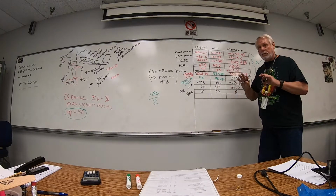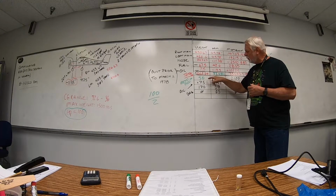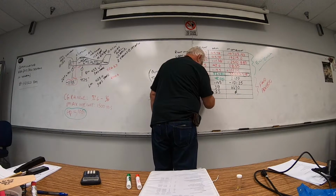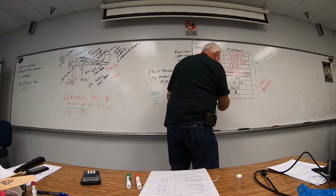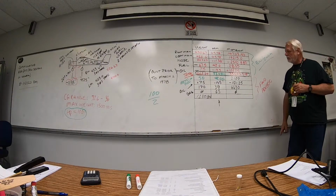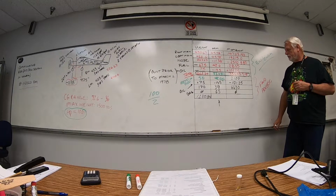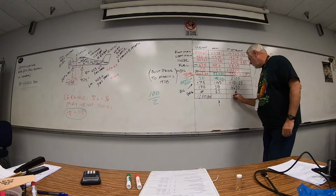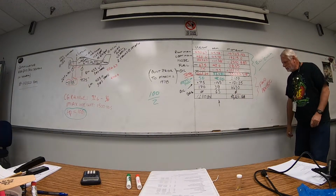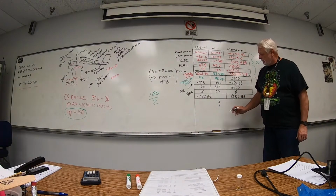Now, remember, we're calculating, make sure our CG still falls within that range on the forward adverse check. So we're going to take our weight, 1,003.34, add 50, add 7.5, and add 170 will give us a total then of 1230.84. Remember, we're calculating this right here, aren't we? So we're going to take our 33,593.518, add our METO fuel into it, our oil that we drained out earlier, and add one pilot. 42,222.268. Lots of twos in there. Now we take that, divide by that. Hopefully we will still fall within our legal range. 34.304.